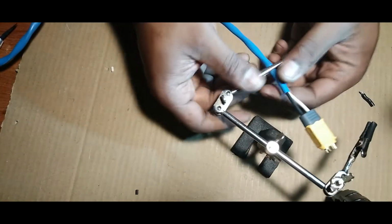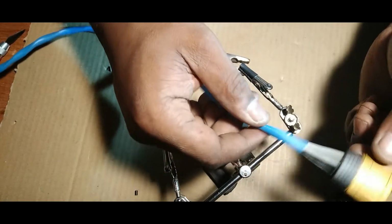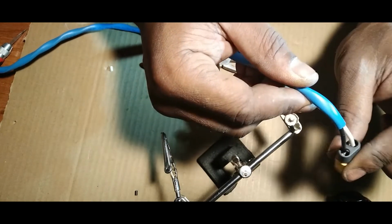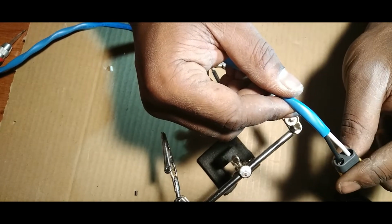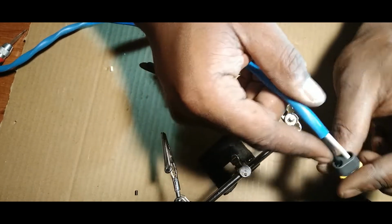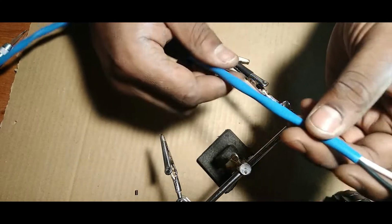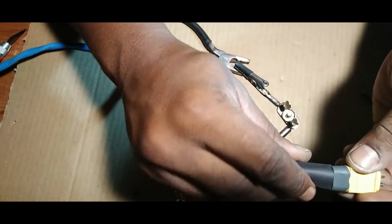I mean that sheath. And to cover, if there's people out there like me, right? I'm sure you don't like to see naked wires like this. And this XT60 is built to fit. This sheath here is built to fit a 10 gauge wire. The wire itself will be 10 gauge inside, but the outside silicone actually fits inside of these holes. See that? That's how I do it. But what I like to do is cover it up with heat shrink. Real simple.